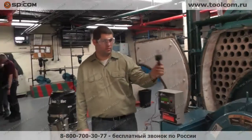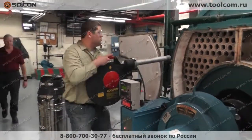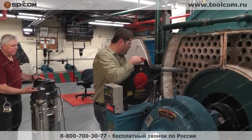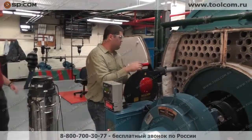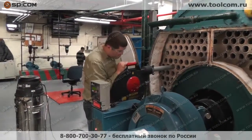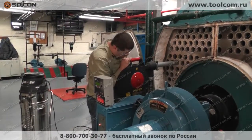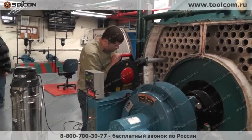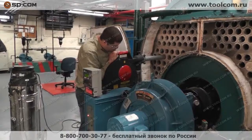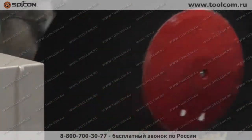Let's put the gun in and punch some tubes. It hits the toggle switch. Right now it's cleaning the tubes at three feet per second. The steel tape inside the gun is pushing and pulling the brush in and out. You have a distance indicator on the side of the gun that tells you how many feet in you are so that you know when to stop the gun.